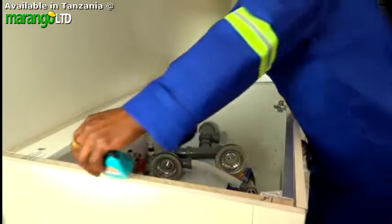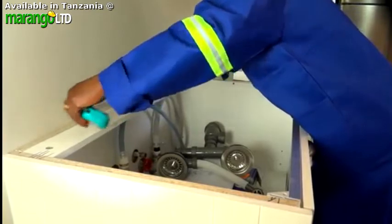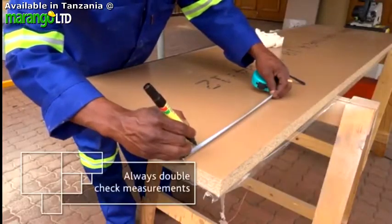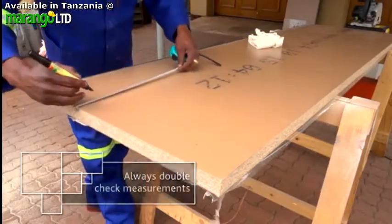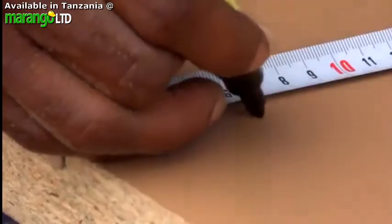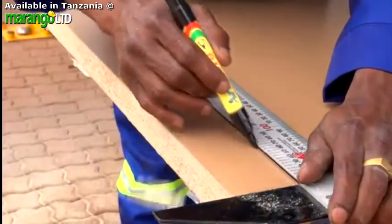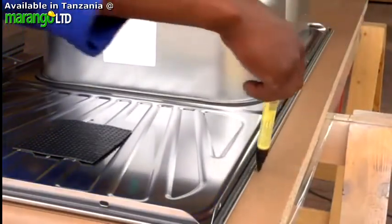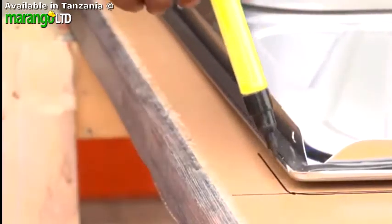Let's talk about making cutouts and inserting a sink, for example. The first step is to measure and mark the underside of your worktop, so you know exactly where the cutout needs to go. You can use a paper template to draw the cutout shape, or if you're making a cutout for a sink, you can position it on the worktop and trace around it.